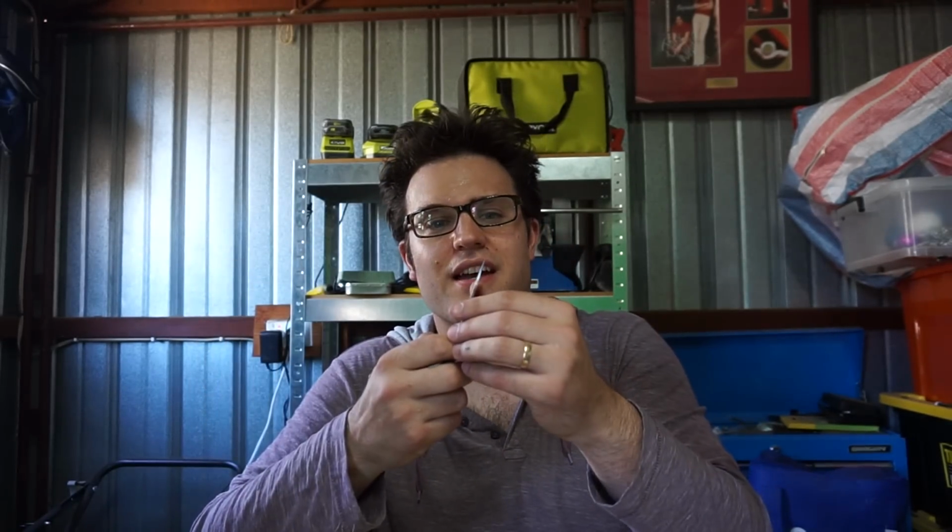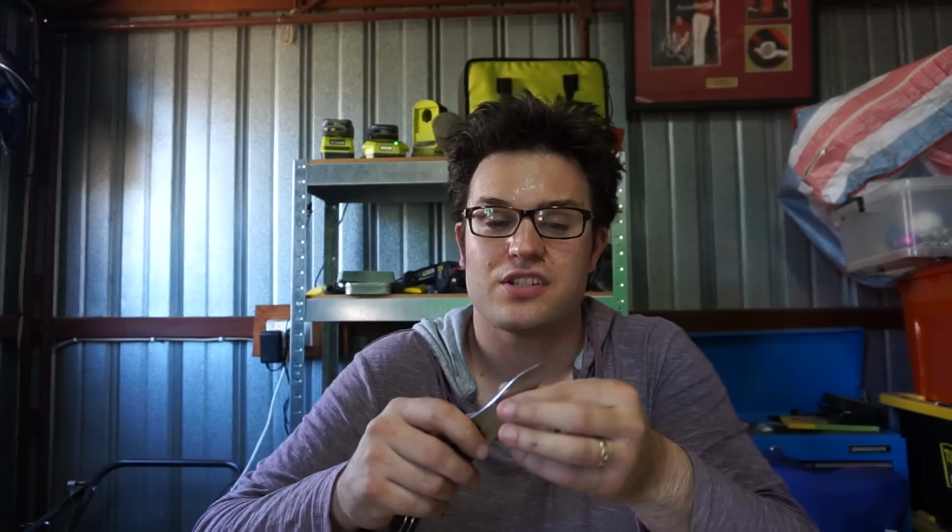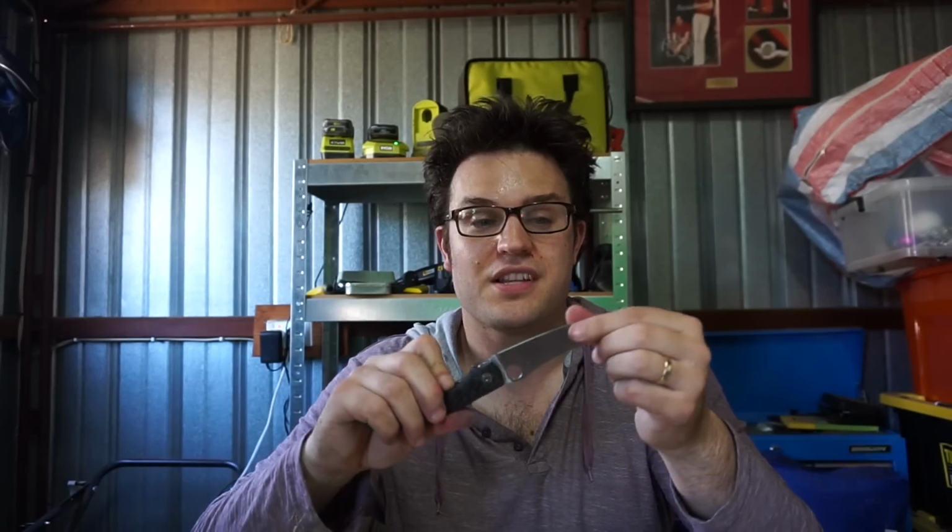A moderate increase to 260 cuts through the rope using my, I guess, somewhat experimental edge. No real direct comparisons can be made because I haven't used this edge before on other S30Vs, but it's interesting to see that steepening that edge out just a little bit generally does increase the edge retention against rope at the very least. That's a pretty repeatable thing in my work in the knife lab.